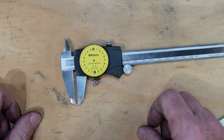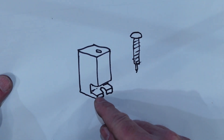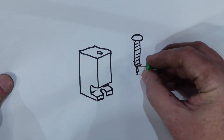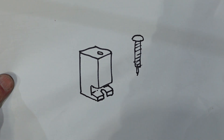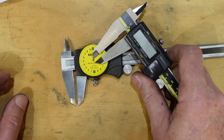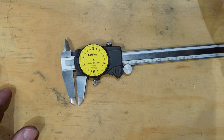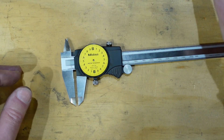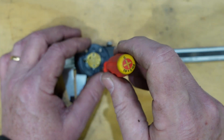The tool I was making up looks a bit like a puller - I had the end of a map pin which I'd cut off and I drilled a hole in an M4 bolt, and I was just working out what size block I needed to make. When I came in to measure the diameter of the shaft with my calipers, that was enough to pop the needle off. So I don't need to make that tool at least not at the moment. There's the needle - the dial comes off and then it's a matter of undoing the screws.